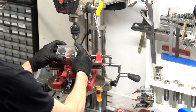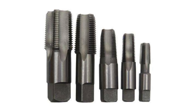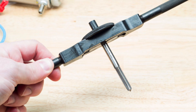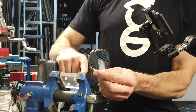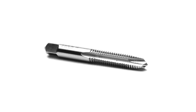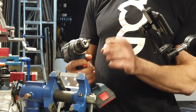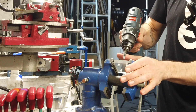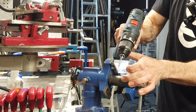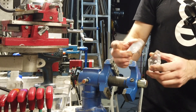When we're done, they should look something like this. The next thing we're going to do is tap these holes, which creates threads in them. This process is done with something called a tap, which when turned carves out threads. You can tap with a tap handle — a tool that allows you to apply a lot of torque to the tap by hand — but this material doesn't need that much torque, so I'm going to go ahead and do this with my drill. It's faster and much easier on the wrists. The type of tap I'm using is called a gun tap, which is designed to throw the chips forward out of the hole. This tap is good for through holes. I'm going to grab my tap in the drill and dip the tap in water as a coolant. As we know, plexiglass gets gummy when it gets too hot. So just stay as straight as you can, or use a tap guide, apply a little pressure, and let the drill do most of the work. We've got two tapped plates, so now we can move on to constructing the container with solvent.